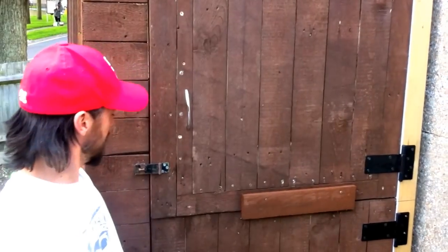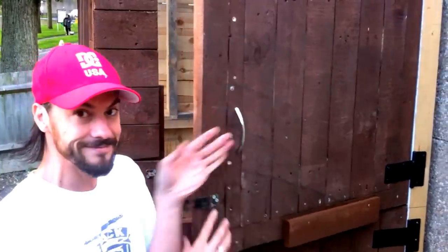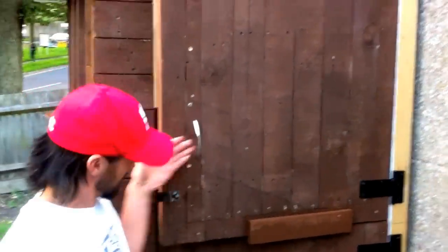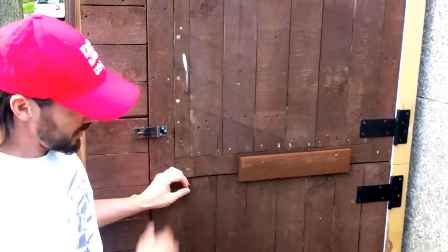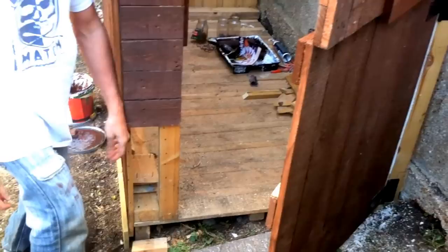I finally fitted the door today — a hell of a lot of hard work but we managed to do it. I forgot one little thing: the door handle. I've managed to take this off an old bedroom unit but it's going to have to do for now until I can find something better. We've also stripped the lock off the other door, but the main problem was we didn't check that one of the hinges was bent, which made the door a little bit loose. We had to plane some off the top but we've now put a stable door in nice and fine, and it's also got a lock. We just need to break the concrete up on the floor and fill in these little gaps and it's almost job finished.